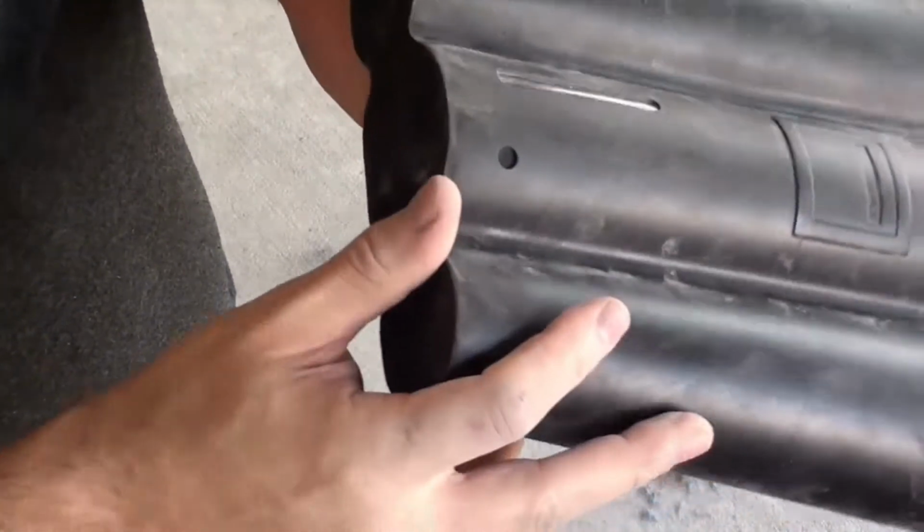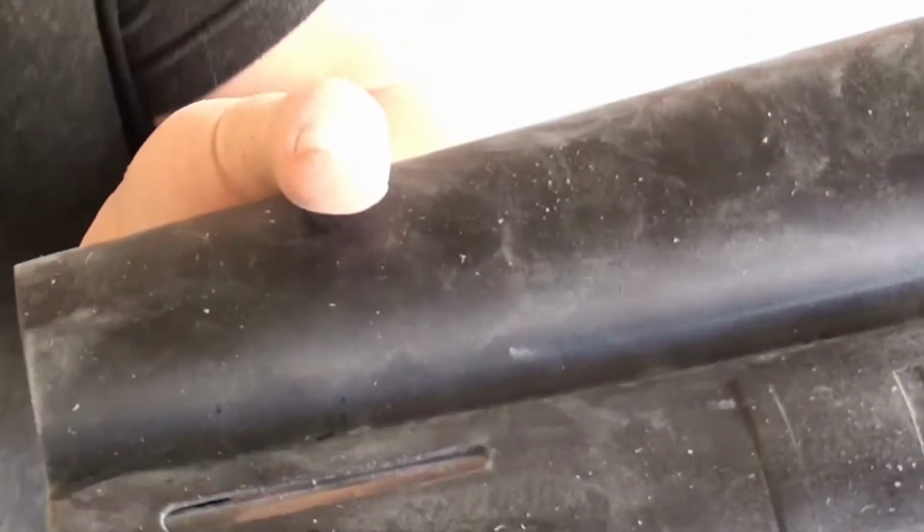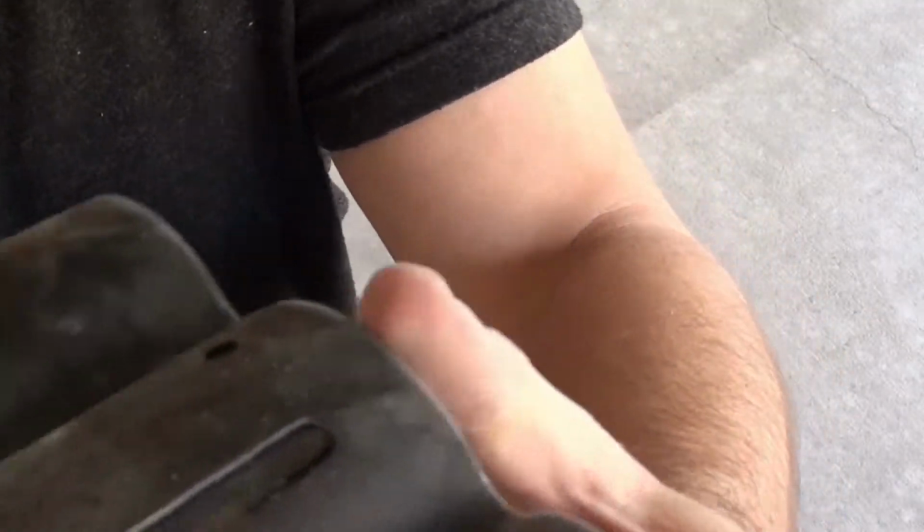You know, if you have some small gaps, it's not a really big deal. If you have any large gaps, then you probably have some uneven surfaces on the back side, and so you can go back with the sanding drum and even those out a little bit more.